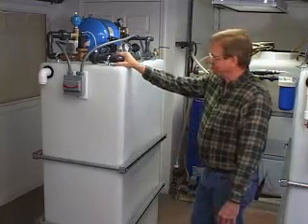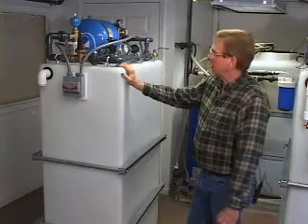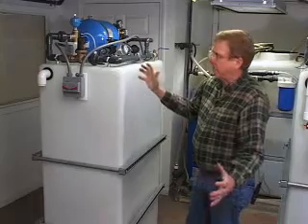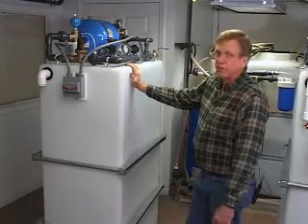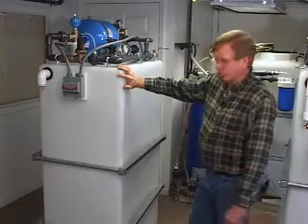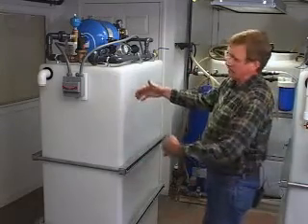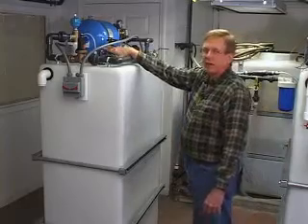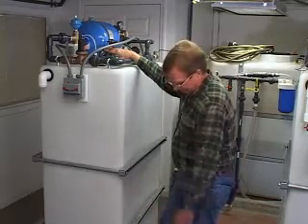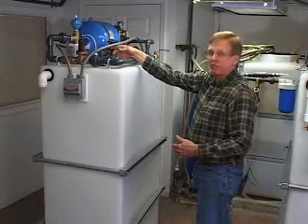So you can really take a system that is maxed out and turn it into one that has room for expansion. You can also serve a very large use — for instance, a restaurant served by a well where the pressure is poor when you have a lot of people in, the bathrooms are going, the kitchen's going, and the dishwasher's going. I can take two of these, slide them up next to each other — they bolt up right here so you end up with one unit. I could take three or four. Only one needs a fill line because we connect all the tanks together at the bottom through a manifold at the drains. My delivery rate then becomes the combined output of all the units connected.